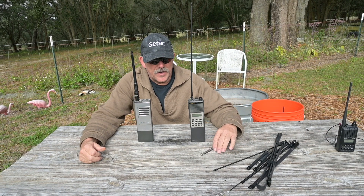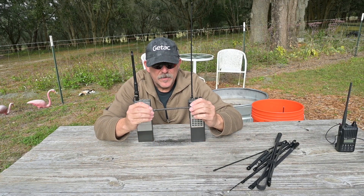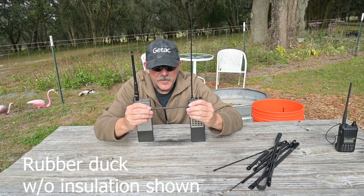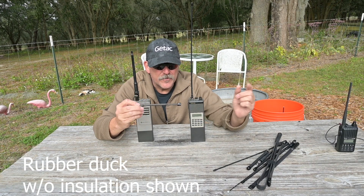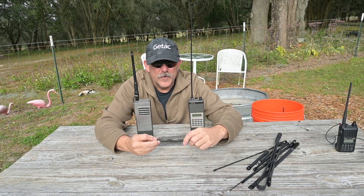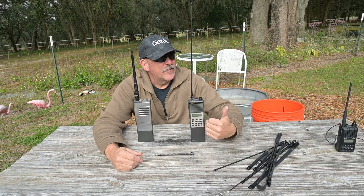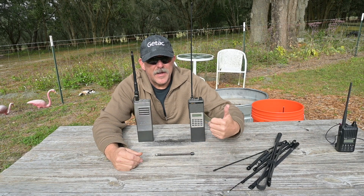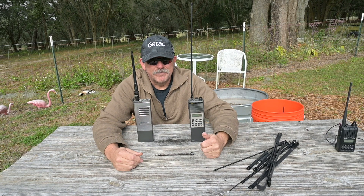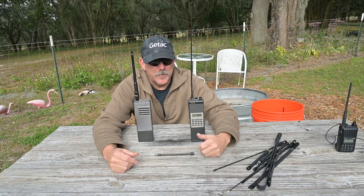Factory antennas in VHF service are a quarter-wavelength — which is this length here, typically. And here's a helical antenna, which is just basically a coil — it's just a shortened antenna. Sometimes you have a combination of this and a whip together, but the purpose of that is to shorten the physical package of the antenna. Typically, physically shortened antennas do exhibit narrower bandwidth and reduction in performance as compared to a full-size whip.